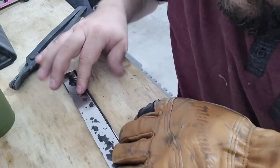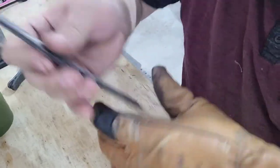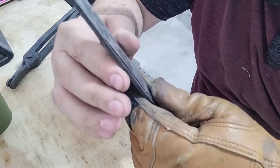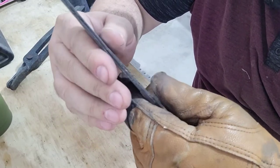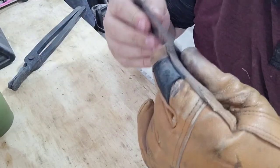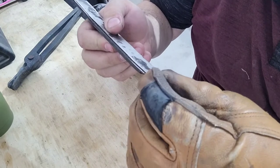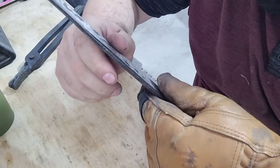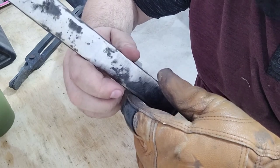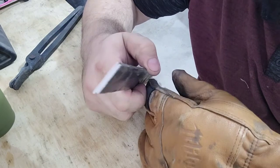All right then, like I said, in the next video, we'll be going back to the forge. We'll be lengthening this out and we'll put in some shape to it so it finally looks like a blade. Doing a hidden tang, so we have to draw this out a little bit more and put the shape in it for a hidden tang. I'm not exactly sure which type of Japanese knife I want to shape it into, but we'll find out then.